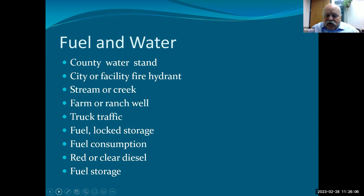You want to emphasize right turns to get to the facility. Also, if you're going to get on any county, municipal blacktop, or certainly any state or federal highway, your water truck driver is going to have to have a CDL — commercial driver's license. A lot of drilling firms don't have CDLs other than the primary driller. You don't want the primary driller chasing water. On a very recent program, we were spending almost $18,000 a month to the county just for water. So it adds up — it's not to be trivialized.